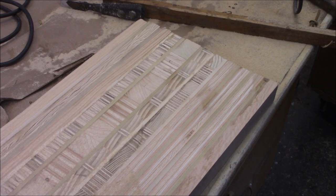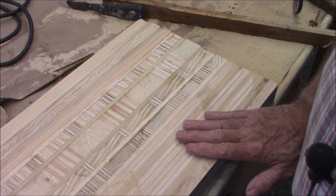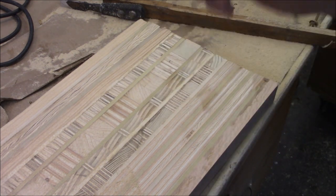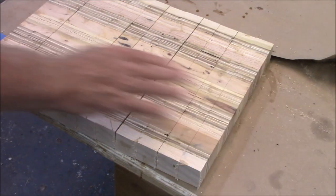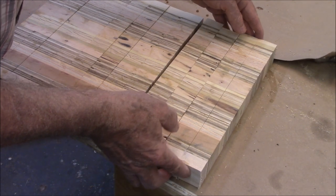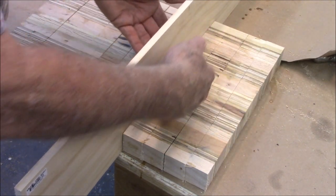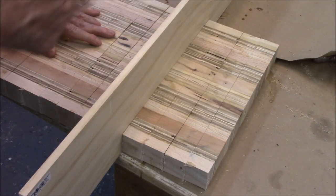Now what I'm going to do is cut this up into one-inch strips. I'm not even going to run this through the thickness planer because this isn't going to be my gluing surface — I'll be putting some more stock through here. This one I did the same way; I just knocked the glue off with my sander. Then I'm going to glue this thing back together using three-eighths-inch pine — I'll cut it to width and between each one of these strips I'll put some of this pine. I'm going to do the same thing with the other one.